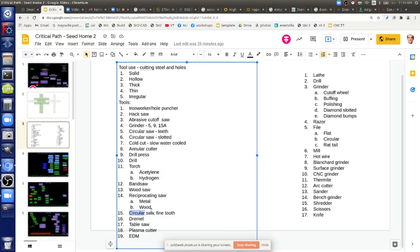By hand you can only achieve so much accuracy — maybe up to a sixteenth-inch accuracy using templates. The accuracy is that of the template plus how straight you're holding the cutting tool. There are circle cutting jigs for torches, where you lay the torch on a pivot and move it in a circle, so for a large hole you can cut with decent precision. For the carriages, the ideal tool would be a CNC torch because we've got some elongated holes for adjustments. For slotted holes, you drill two holes next to each other and torch out the material in between.